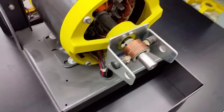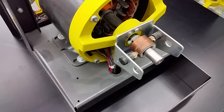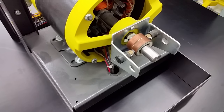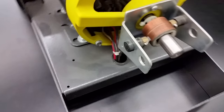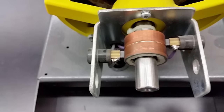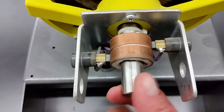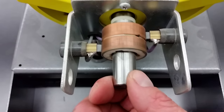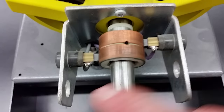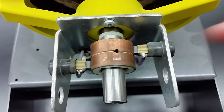Viewing the motor from the rear of the module, note that the two rotor windings are brought out to two slip rings via a slot in the rotor shaft. Identify the two slip rings and the brushes. You can clearly see that we have two slip rings — it's a concentric ring of copper, and on each of the rings there are two brushes, one for each slip ring, with an insulator between them.